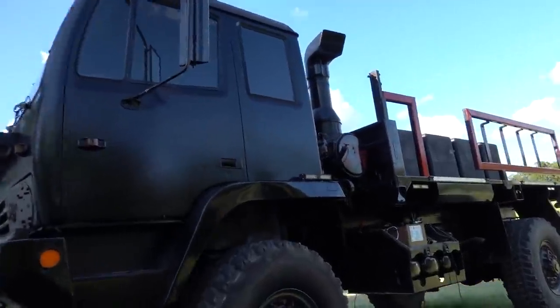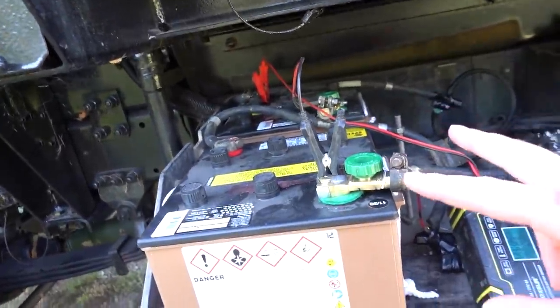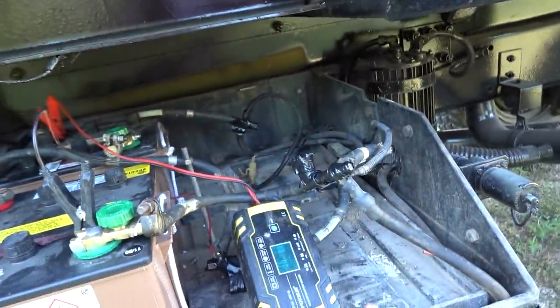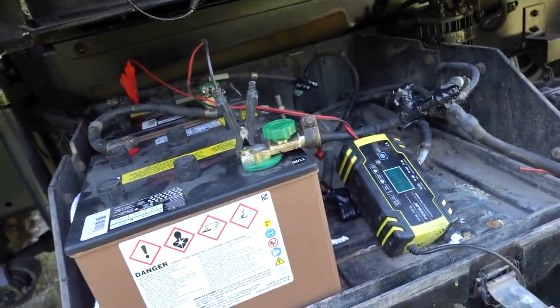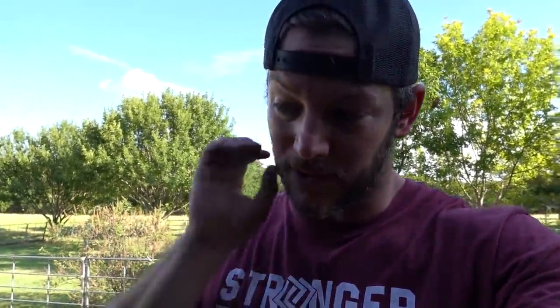While I was working on the bike, I've also been charging another vehicle — a much larger vehicle. What up, fire truck! This is Master Chief. As I was telling you guys in the last video, we just have two batteries now instead of four. There are spots for two more, but according to our research we don't need those. The four batteries are so you can have more amps for cold-weather starting, which is rarely needed in Texas. But it does seem to be having a little problem starting — doesn't seem like it has enough cranking amps. I've been charging them to get them topped off.